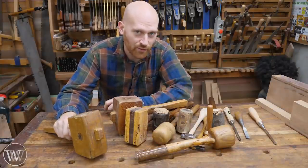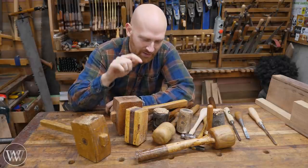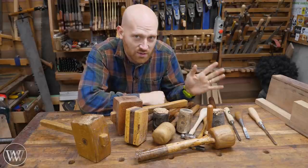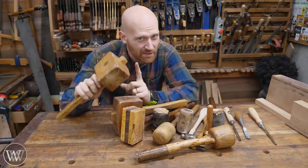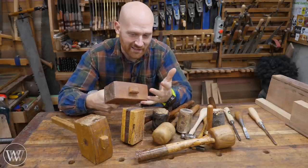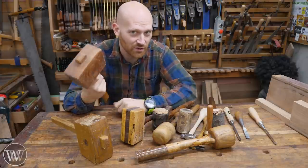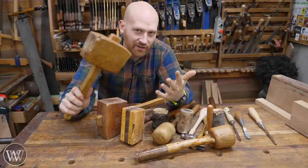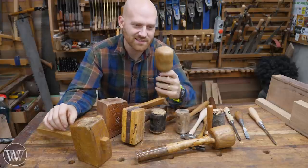Now what is the best material for a mallet? That really depends — I have white oak, cherry, maple, walnut, pine, live oak, leather, metal, the list goes on and on. Basically, the heavier the wood, the more force you can put into it, but the better chance your wood is going to dent or harm your work. The softer the wood, the less weight it is, so it's not going to be able to persuade things, but if you hit something you're probably not going to hurt the work as much as you're going to hurt the mallet. For my joiner's mallet, white oak — I absolutely love it. Pretty much anything white oak or harder is pretty standard. If I had my all-time favorite, it would probably be live oak, but that's just because it looks really cool.